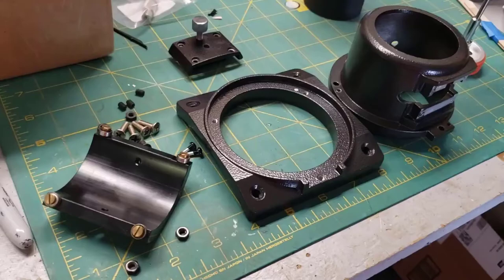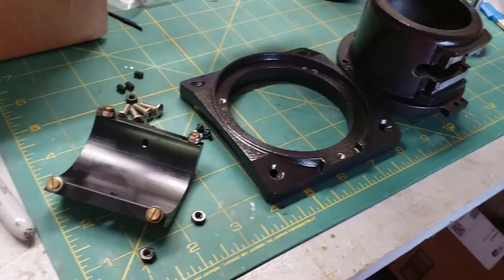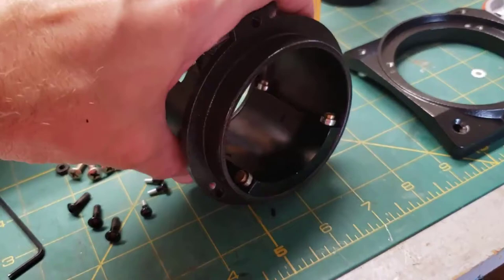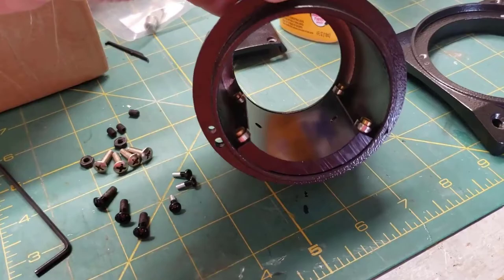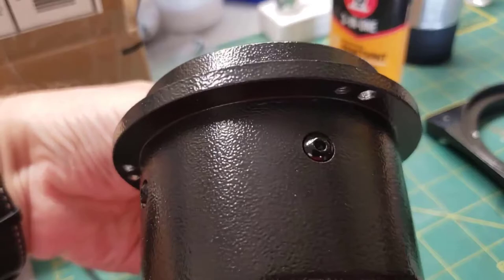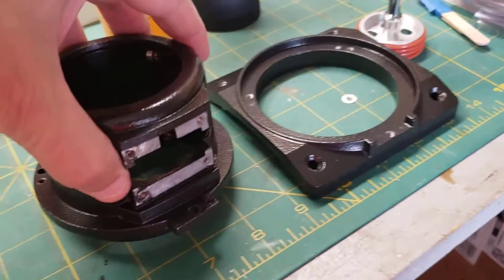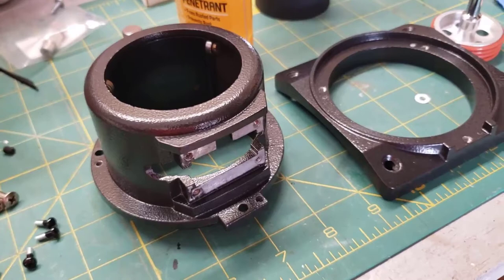Here's the back plate that tightens everything — it's got a little Teflon bearing that you can adjust with a set screw right in the middle. Step one was putting the bearing plate in; you can see it right there with the four bearings installed. It's held in by these two Allen screws, which have been CLR'd to get the rust off and then gloss painted black enamel. Next I'm going to put this in the base — based on another Crayford I have, I'll use a spacer of two business cards to keep that offset.